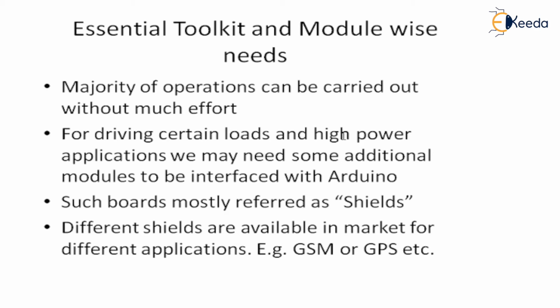For example, if we need to drive a DC motor with low current, typically within a range of 5 volt, it can be handled. But for higher current and voltage, such as 12 volt driven motors available in the market, one needs to use proper driver boards, because the sinking current may damage the Arduino pins, which could be very large damage to the prototyping platform, and can damage the interface or central IC of your Arduino board.